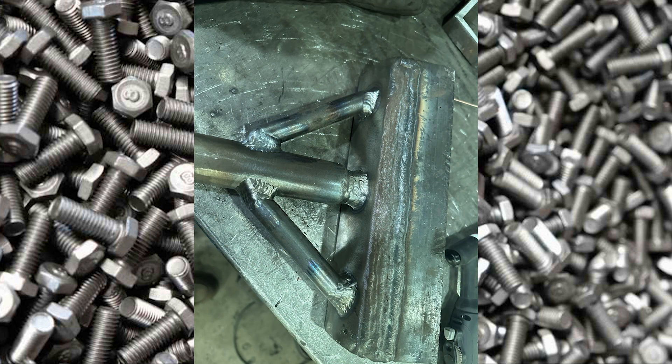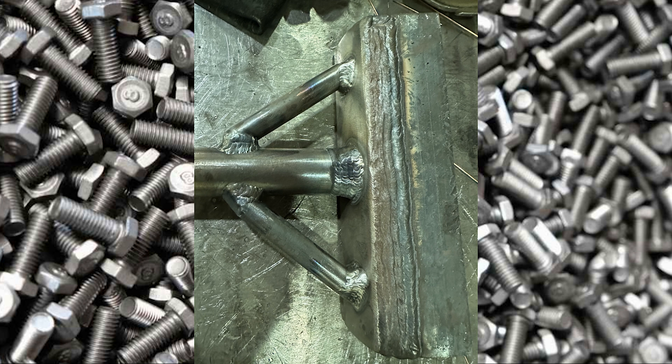More passes — still maybe two passes away from being filled up on the main shaft, but the outer supports are pretty much where they need to be. I'm not a huge fan of doing wide weaves with TIG; for something like this I probably should have done stringers. But honestly, I'd already wasted hours and hours and still had a feeling they were going to break this one again. One-piece forgings are what you should be using in a jackhammer.